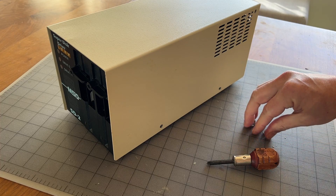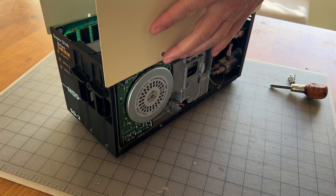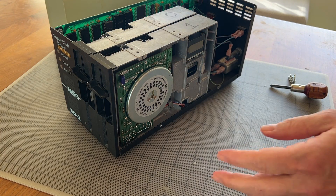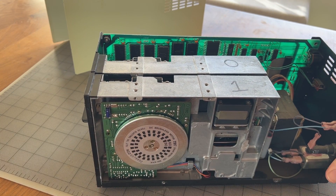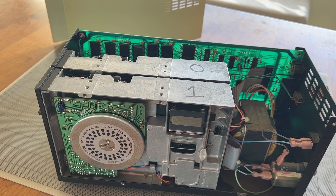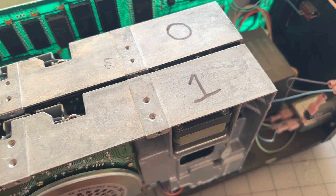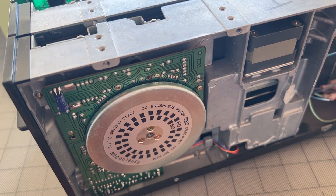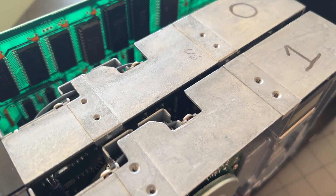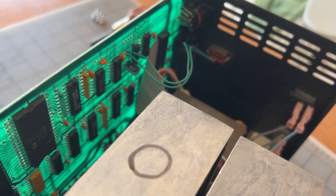The SD2 consists of a PSU, a controller board, and two TEC360K PC floppy drive mechanisms. They were modified by MSD to be compatible with the GCR recording format used by all Commodore floppy disk drives at that time. Like a lot of old tech, the caps on these ancient drives are notorious for leaking. My SD2 needed work when I got it in 2022 — both TEC FB501 drive mechanisms needed to be reworked. All polarized electrolytic capacitors on both analog boards and both spindle drive boards needed replacing, as did the smaller electrolytic capacitors on the main board.